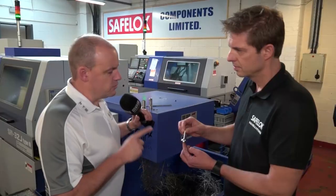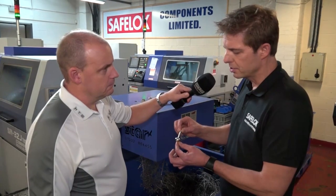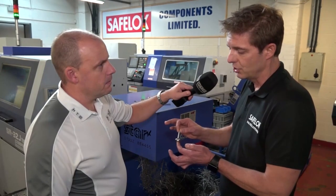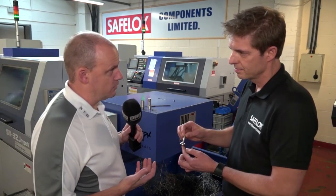So why do you think the machine is able to produce such a better surface finish for you? It's a number of reasons really. One is mineral oil helps a lot. Also, the rigidity of the tooling and the slide — these are dovetail slides, I believe, in this type of machine — and it does seem to give you vibration-trouble-free finishes. So you mentioned the second point about the speed of production and the fact you've automated it.